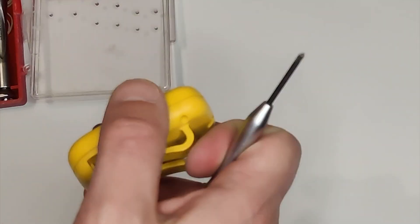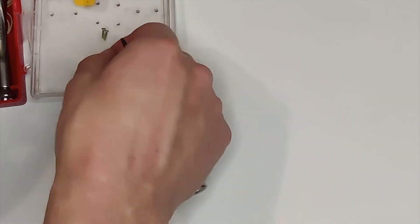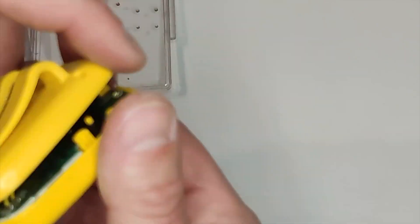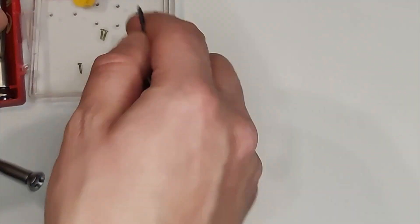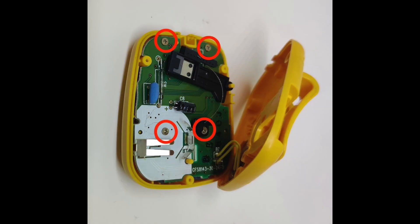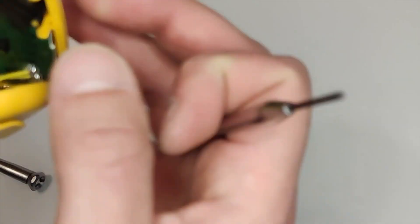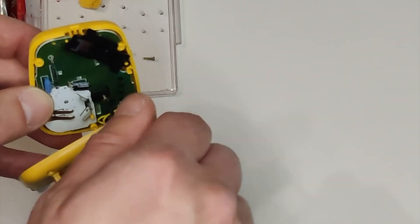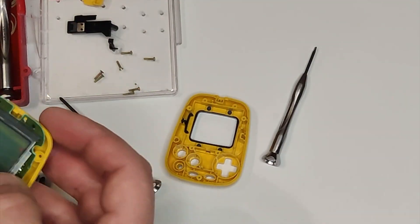So let's get going. I'll remove the three Phillips-head screws holding the back half of the casing on, and I just want to be careful not to pull the back half off since there are wires soldered from the battery compartment to the motherboard — we can just let it hang while we keep going. Next, there are four screws holding the motherboard in place. I'm gonna be very careful taking the pedometer assembly out. It's held in place with a screw and a very thin, easily losable wire, and that's connected to the bottom of it so it can bounce up and down, simulating a walking motion.